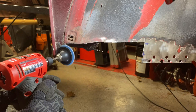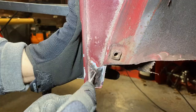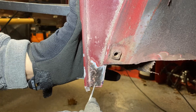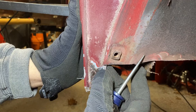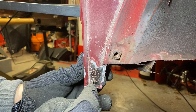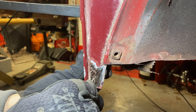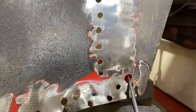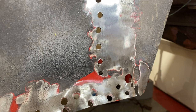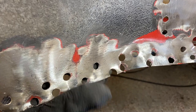There's some pitting there — poke around and see if it goes through. The metal's bending a little bit — this is kind of thin sheet metal, I can move it with my hand, but it doesn't mean it's weak or rotten. It looks good, it looks fine. So we'll stop there and continue on. There's another spot over here — this has been separated and it's rotten through. So first I'm going to bend this back where it was. All this does is wrap around the heater channels and comes straight down.